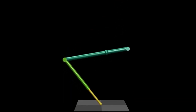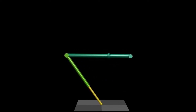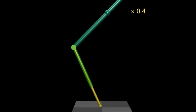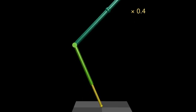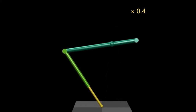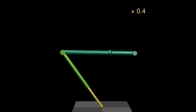This next animation shows our most recent work, which hasn't been published yet. One of my students is looking into what happens when we combine the balance controller with a passive spring-loaded joint. The robot is a planar double pendulum with a springy leg to help it jump high, but which interferes significantly with balancing motion while the robot is on the ground. As you can see, the robot is still able to balance and track motion commands in spite of the disturbances caused by the springy leg, which includes slipping and loss of contact between the foot and the ground. Furthermore, the balance controller is also acting to damp down the vibrations caused by the spring. With just one actuator, the control system is balancing the robot, tracking a motion command, and damping oscillations.